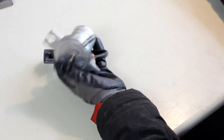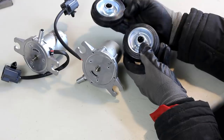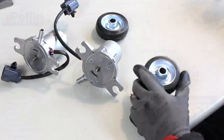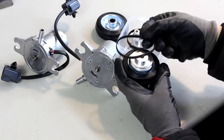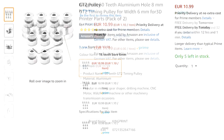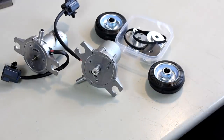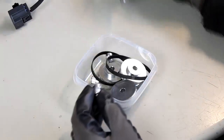I will leave comments about specific retailers and products in the comment section. The wheels I'll use are 75mm in diameter, made from galvanized steel and rubber, with a roller bearing for 12mm axles inside. To connect the wheels and motors together and allow for a reduction in speed, I use pulleys and tooth belts of type GT2. Just a few years ago these parts were hardly available, but since they're used in 3D printers they're now quite cheap and abundant. Both the motors, wheels, and pulleys will have to be customized to work in conjunction.